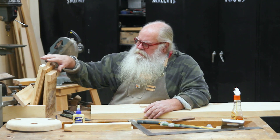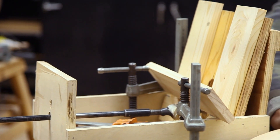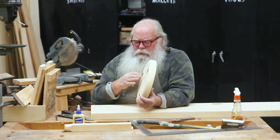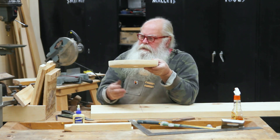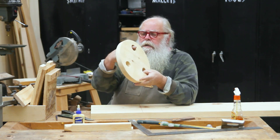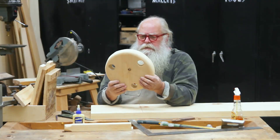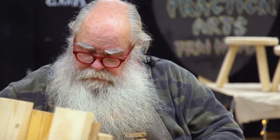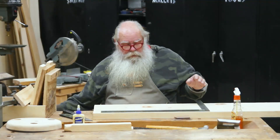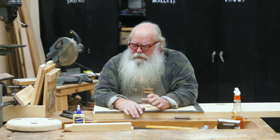You may be able to see this piece of equipment I made — this is for boring the holes. It's a jig that's set up to give you the exact angle you need to bore these holes so you have the correct angle of the legs. This will be a different video showing how to make this, but you need a boring bit with an inch and a half diameter hole. I want to start with the very first day in the wood shop in eighth grade. After going through all the safety warnings and how to operate your tools safely, then they need to begin with their wood.